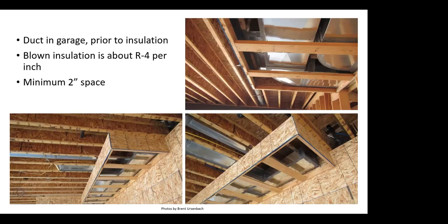But if you were to build a joist cavity with insulation and have an air barrier, and then maybe do continuous insulation around the box out there, then it's all part of the conditioned space. Yeah. That's kind of my interpretation, my recommendation.